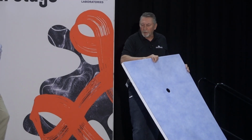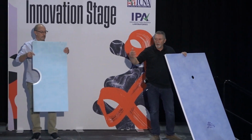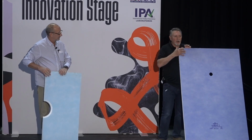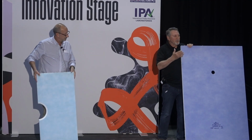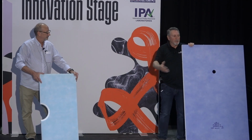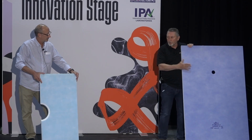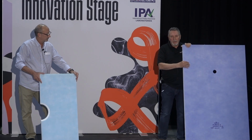We have it unwaterproofed, or we have it pre-waterproofed. The pre-waterproofing is our Noble Seal TS membrane. It is a 30 mil CPE membrane that we've had out since 1982, the first bondable fleece membrane in the business. We still have the exact same membrane. It's a commercially rated steam room membrane. With this membrane on this base, it is a lifetime warranty.